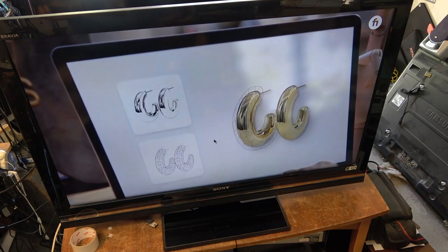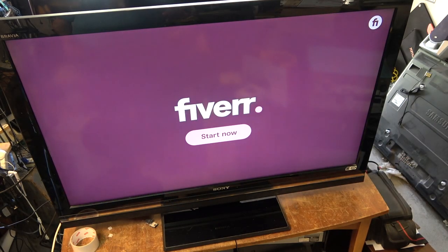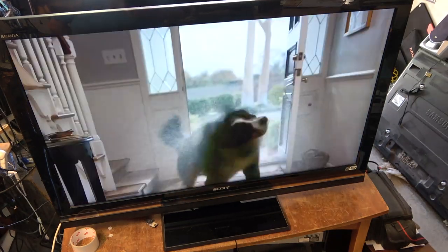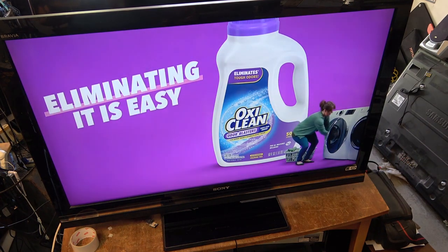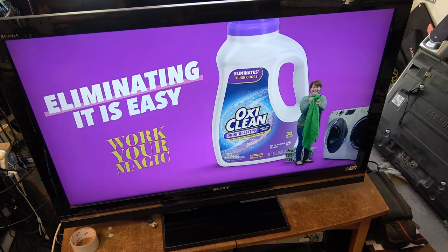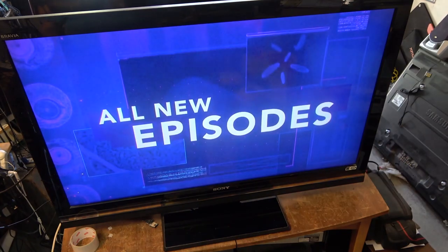This one has now been running for about two hours. I ran it on analog for a while, and I've had it running on HDMI input off my cable box — I'm only showing this because it's commercials. It hasn't faulted yet, so I've got to get in there and take a look at the power supply board and look for bulging caps or loose grounds. Let's get the back off this one.